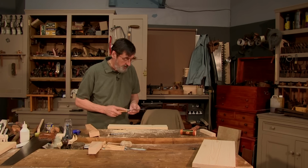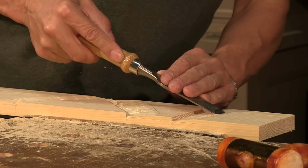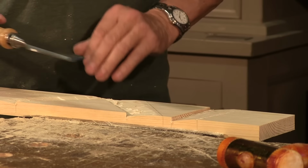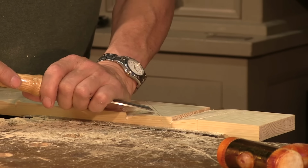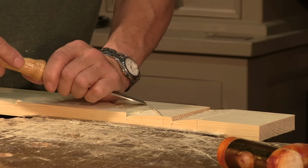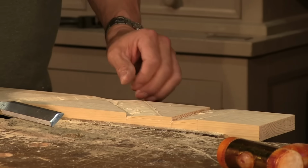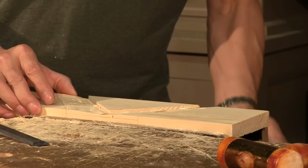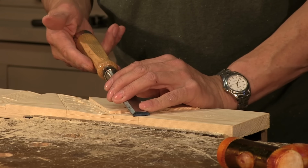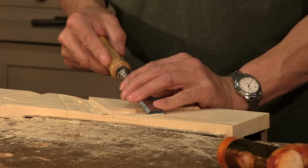Into the vise. Watch here now. You can see why these knife walls are so important to us as woodworkers with hand tools. This one. Just resting on the top, guiding the chisel tip. This one is my power. And then I just take the heel of my hand in here, just a little bit. It's not very hard. It's not hard on your hand, this.